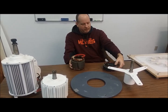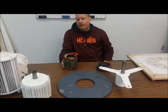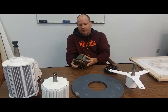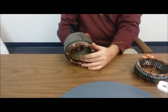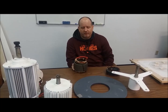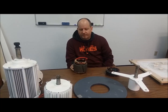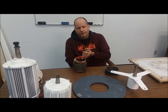With our White Lightning PMA, you have a lot of area in which magnet comes in contact with the copper. The magnets on this rotor are maybe an inch wide, and when you look inside you can see the laminations — a large area where you've got more magnet in contact with more copper, and you get more power out. People have posted 12-volt and 24-volt customer videos on YouTube, and at 12 or 24 volts this thing punches out 40 to 60 amps at the NREL rated wind speed of 24.6 miles per hour.